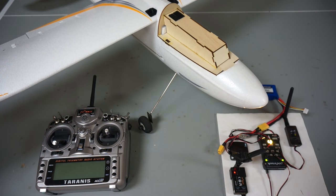Thank you for tuning in. I wanted to revisit this Bixler 3 build where I had Pixhawk installed and was going to demonstrate inverted flight. I was at the field the other day, Pixhawk was running well, got a few flights in with fly-by-wire A mode, and then all of a sudden I got the yellow flashing LED - went from green to yellow and I was no longer able to arm or fly.